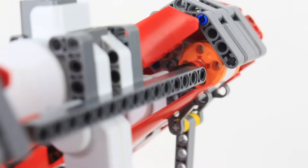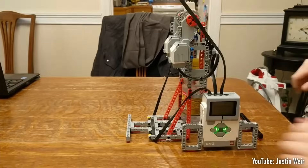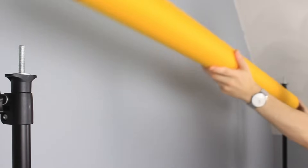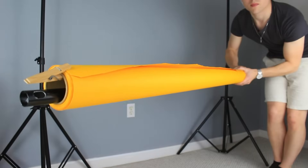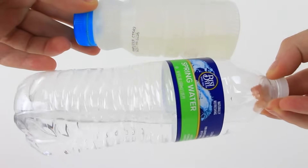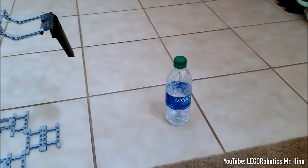Not only for the athletes, but anyone even trying to make one of these things. The big challenge for this robot is generating enough force to 360 a 500ml bottle. Everyone else on YouTube used bottles three-quarters or even just half the normal size, because otherwise the robot would lose hold of the bottle too easily. That's not only a matter of volume — if you've ever held a long pole, you'll find it relatively easy to hold it in the middle, but a lot harder to hold it from an extreme end, because you'd be further away from the center of mass. The same struggle exists with the LEGO gripper holding a bottle sideways. Not only would a large bottle weigh more than a smaller one if both were filled to 25% capacity, but the distance between the large bottle's cap and center of mass would be greater too. A solution could be having the robot hold the bottle from the bottom, but that would feel like a compromise.